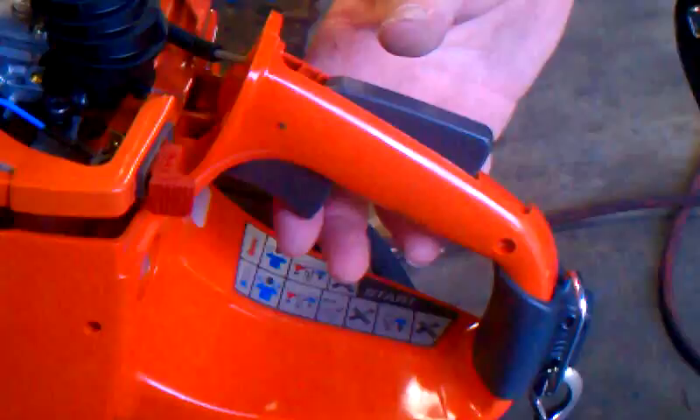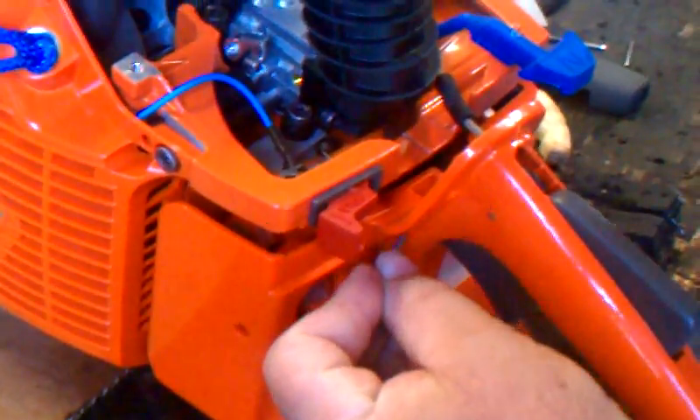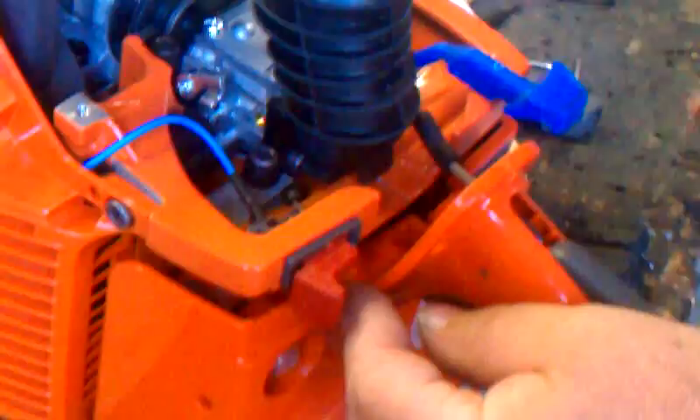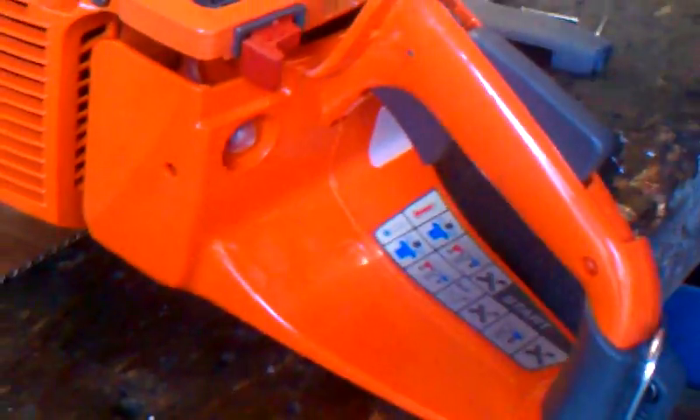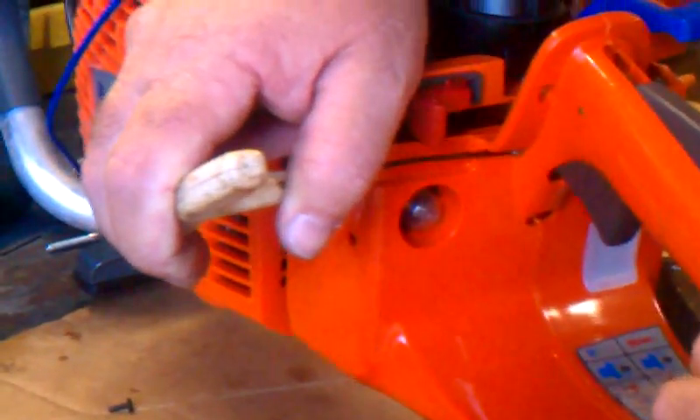Insert your drive pin back into the system. Up here on top you'll see the trigger assembly, and you have to line it up — you're going to have to line that hole up for the trigger for the drive pin. Once you line up the drive pin, go to the other side. The drive pin will push in. You'll see the trigger's working fine — push the drive pin all the way in. Sometimes you have to move the trigger a little bit until it's in solid.